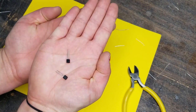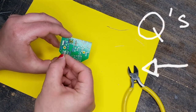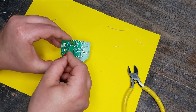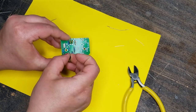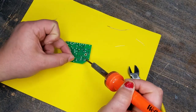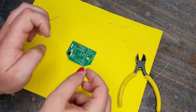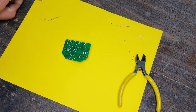Now that we've got our resistors and capacitors in, it's time to put in transistors and diodes. In this Mosrite Fuzzrite project there are no diodes except for the LED, but there are two transistors. Transistors are usually signified by the letter Q on the board, so you're looking for Q1, Q2, etc. If you're using a pre-printed circuit board, it prints the shape around the holes to show the direction the transistor should go in. The transistor I'm using has a half-moon shape, and they've made that same shape on the board so I know which of the three prongs goes where.